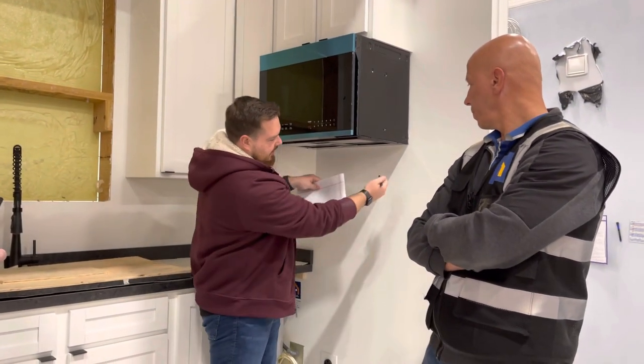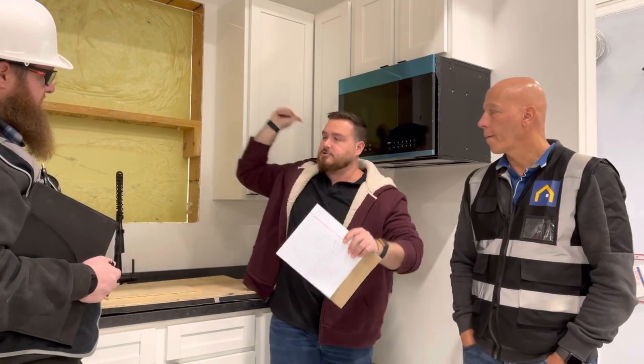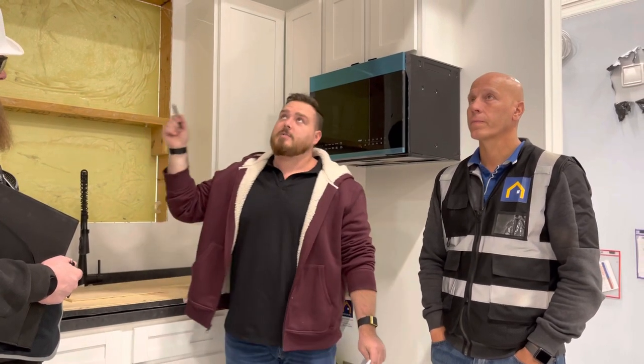And then these areas are not 45-degree cuts; they're 40-degree cuts. So you get a 5-degree. So you get a sharp point, no matter what the wall and the ceiling you're doing. Because the wood just kind of flexes just a little bit as you nail the thing up. So that's happening with the 2.0 cabinet. Almost like the crown molding. Basically the crown molding. Hiding your lines.